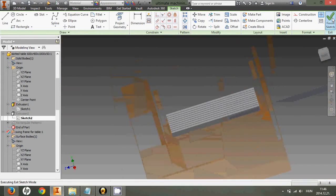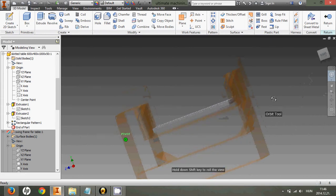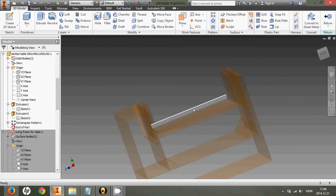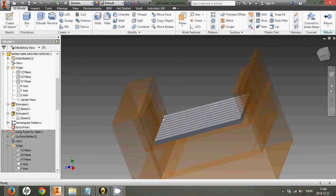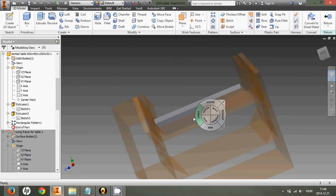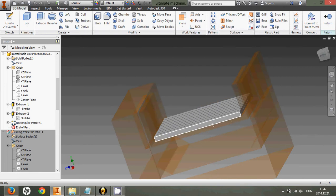You will see, and you got a nice table. What you have to do when you finish with the frame is screw that on the frame, machine one side, screw that anyway, or just, I don't know, clamp it there or whatever you want. Machine the top, make your holder thread, so drill and tap it, turn, flip the table up, that will be the bottom, screw there for the finish place. After, you can make the real top flat around, and also these slots as well for yourself.